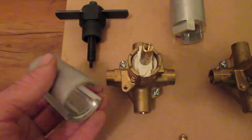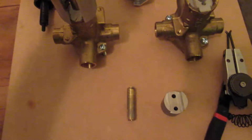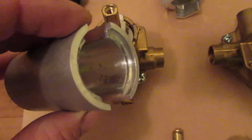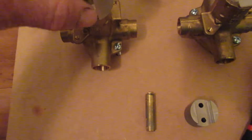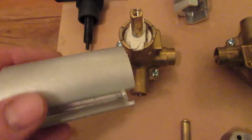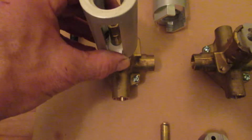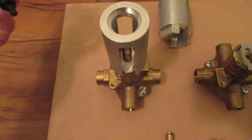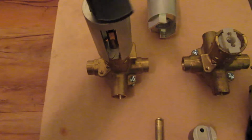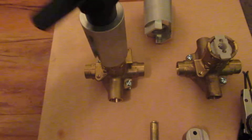We've machined this aluminum assembly. This fits perfect over the cartridge. It has little grooves around, so it sits right onto the valve body, and you can see there's two large slots, of course, on both sides for the two tabs that protrude on the cartridges. You simply stick that over, and then this other tool, which we give you as part of the kit, simply just screws on to the cartridge. So you're threading on the bolt, which is a 10-24.